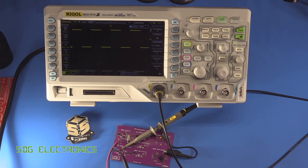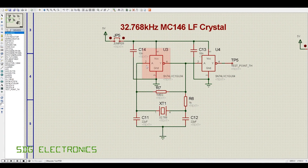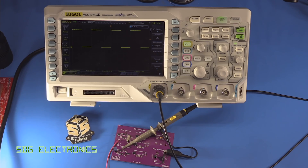After a little bit of tweaking with some of the capacitor values, we've got the oscillators working properly on the PCB. What we've designed here is a Pierce oscillator using an inverter to drive the crystal. The crystal along with two capacitors forms a bandpass filter. There's a resistor across the inverter so it operates in its linear region with some gain, and then a resistor to limit current through the crystal to stop it being overdriven. The feedback resistor ended up at 10 MΩ, and capacitor values were 22 pF. The output is fed through a Schmitt trigger inverter and then out to the oscilloscope and frequency counter.